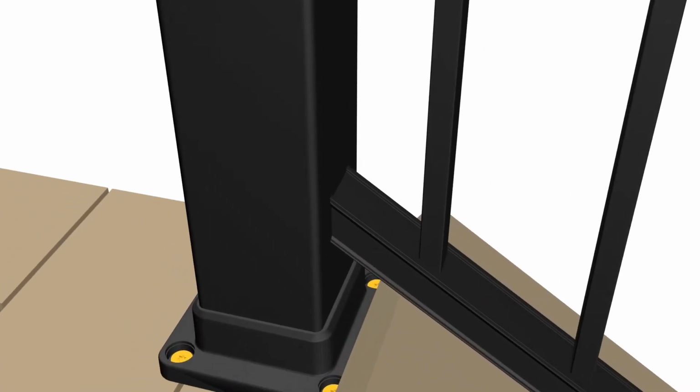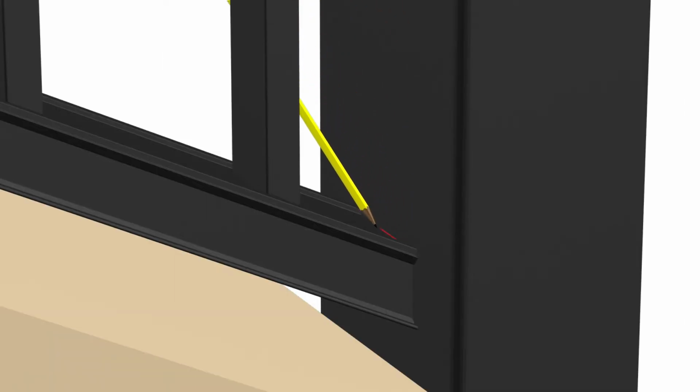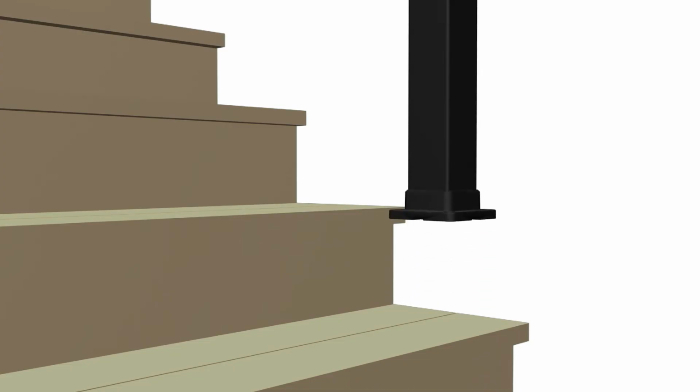After the stair balustrade has been cut to proper size and angle, place the balustrade on the 90 by 45mm timber board or hold 45mm above stair nosing between 2 posts. Using a sharp number 2 pencil, draw a line across the top of the lower picket channel in 2 places. Remove balustrade and bottom post.